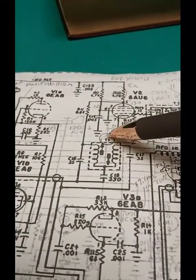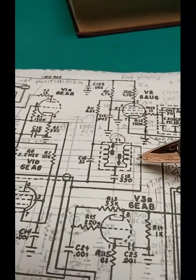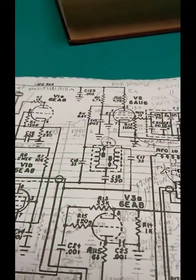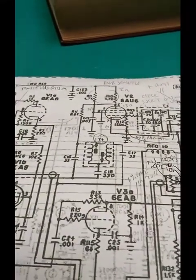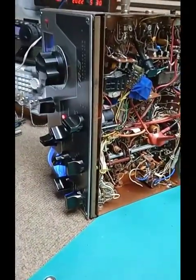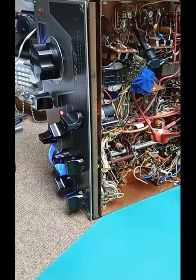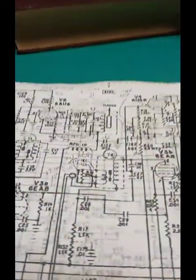And what that load is doing is dividing that transformer in two so that each side of this mixer circuit can be adjusted more independently to a peak for each side. If that isn't done, it's going to be badly out of alignment and transmit power will suffer, and it'll be possible to get a fair amount of power at some frequency, but as the VFO changes, that power will drop off. That's a problem I've got here now. It made full power at 7.3 megahertz, but down towards the extra class phone band, it wouldn't make full power, and that implies the VFO transformer is out of alignment.